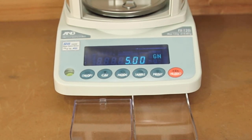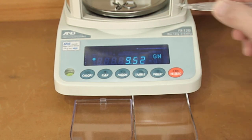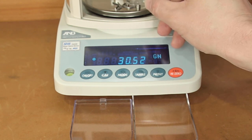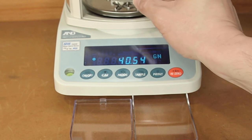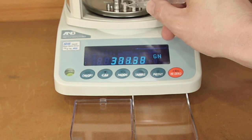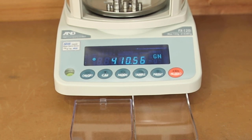Validating our check weights on the FX120i: 5 grains, 7, reading 7.02, 9 is 9.02, half a grain takes us to 9.52, one grain extra makes 10.52. Then we have our other weights — an additional 20 grains takes us to 30.52, an additional 10 should be 40.52. Now we're at 40.54, add another 20 grains: 60.54, add another 50: 110.54, our 100 grain weight brings us to 210.54, and another 200 grain weight brings us to 410.56. That should take us real close to our 500 grain limit — let's see how the scale does.